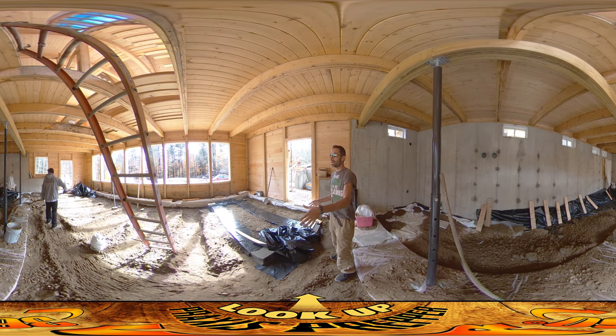As it ended up, I bought one pallet of cinder blocks and it seems like I need about two and a half, so I ordered two more — that'll give us a little bit extra. For this space, which is about 14 feet by about 30 feet, with them spaced out as I have them here, it's between two and three pallets of cinder blocks, eight by eight by sixteen. That's it — thanks for watching.